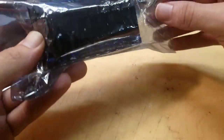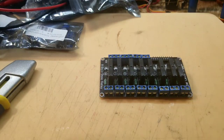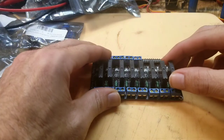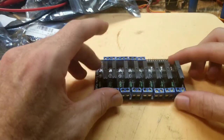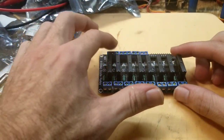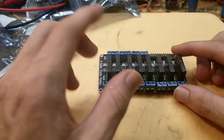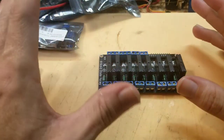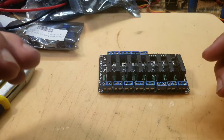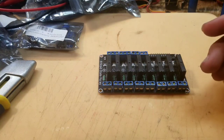And what I'm going to use this for is, believe it or not, another outdoor project, but something you haven't seen here on my channel. It is going to control my Christmas lights. And that one's bent. Hopefully it's okay. So what it does is basically your Arduino sends a signal to these pins, and when it sends a signal, it closes this solid state relay that connects these terminals together. So I can basically program Arduino to turn off all these 8 relays at any point in time, in a sequence: off, on, flashing, flickering, strobing, pretty much anything I want to do within the constraints of the program and my patience of programming.